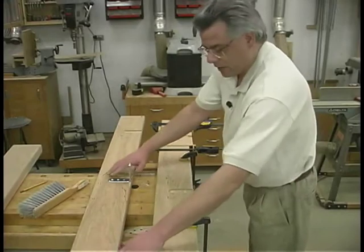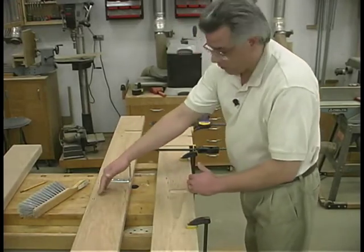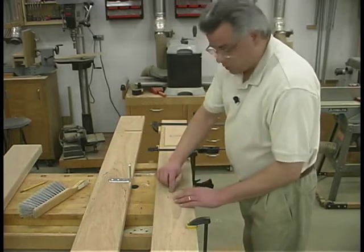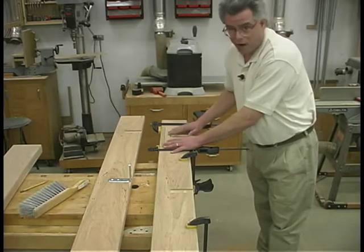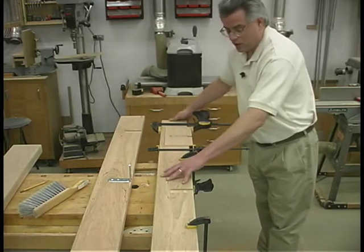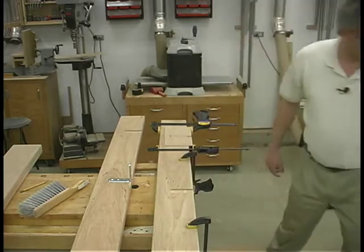For the side rails, we're putting in 3 of these angle brackets. For the head and footboard rails, there'll just be 1 in the center. To do the layout, all I'm doing is just placing a mark at each of the locations. Then I clamp my jig in place, roughly centered over that mark. If we're off by a little bit, it really won't matter. With the jig clamped in place and my board clamped down to the workbench, I can go ahead and route out that slot.